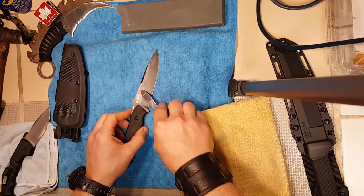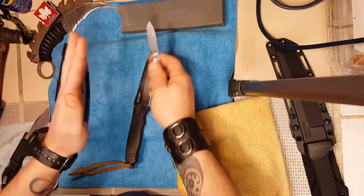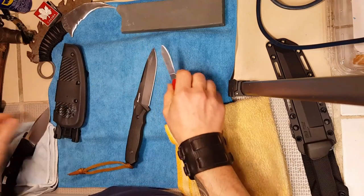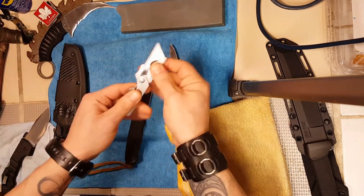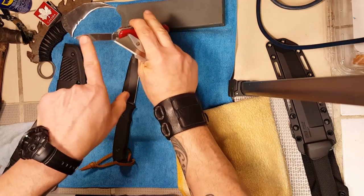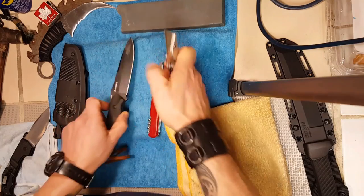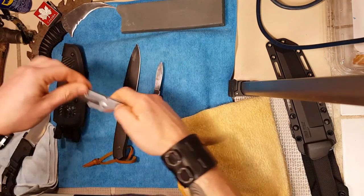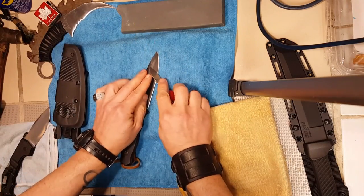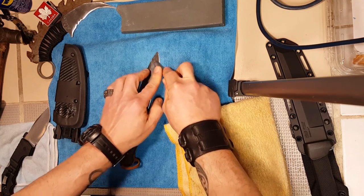You want to work your way around. Another thing to be careful of are the natural grind lines of the knife — you don't want to press too hard up against the edge of that or you'll gouge it, so you need a little bit of skill. Also, don't use a straight-edged tool — a straight edge is going to gouge. You want a rounded edge because it's more forgiving and you won't make a mess.